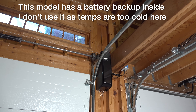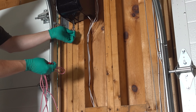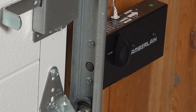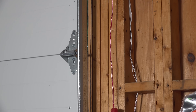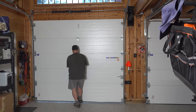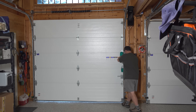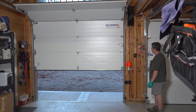If the power should go out, they've included a safety cord. This cord attaches to the bottom of the opener but requires a lot more pulling force — meaning no one can just stick a coat hanger inside your garage and easily open your door. Here's how you open a jackshaft opener if there's a power outage: slide the deadbolt manually to the open position, give a really strong pull on that safety cord, and now the door operates manually. To reset it, just close the door, pull that safety cord again, then open the door once electrically and close it — everything will reset to the original positions.